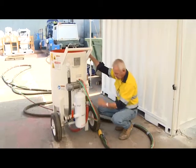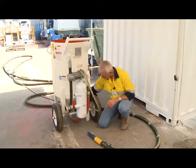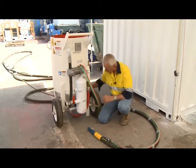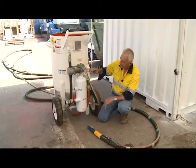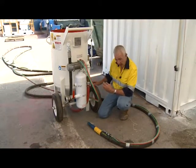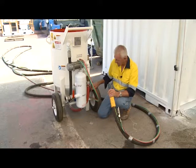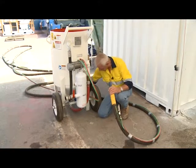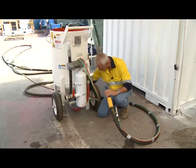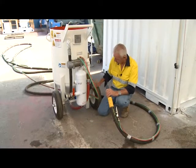This pot is only pressurised when you depress the dead man. On the bottom of the pot is a valve with a blue knob — that knob governs the amount of abrasive that comes through. As this is a micro combo valve system, the valve on the bottom controls how much grit comes through to the end of the blast hose. You can turn this valve in or out while the operator is blasting to adjust the appropriate amount of grit coming through.